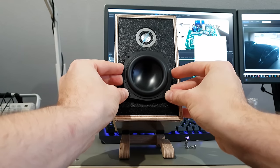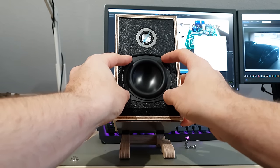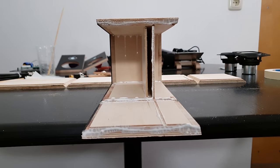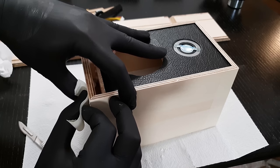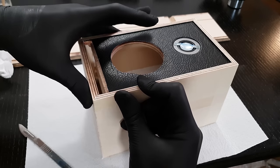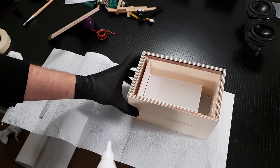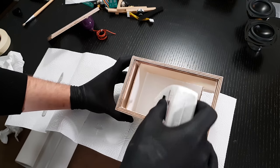I'm not changing any camera settings over the course of this shot. But wait — we haven't even finished the assembly. For the cleanest look, I'm aligning the corners and wrapping everything in masking tape tightly. I've inserted the front panel temporarily for alignment. Before that goes in permanently, I'm adding another bead of glue to the joints to seal everything securely. The same steps apply to the second cabinet, and then I'd recommend letting the glue set overnight.